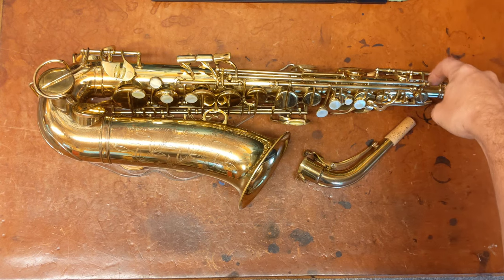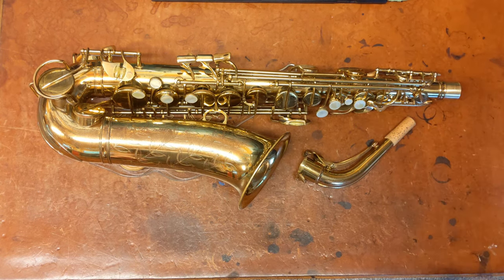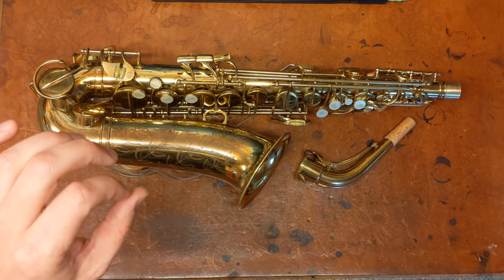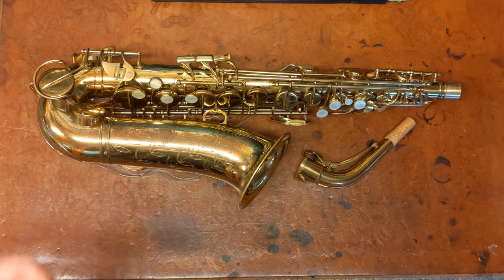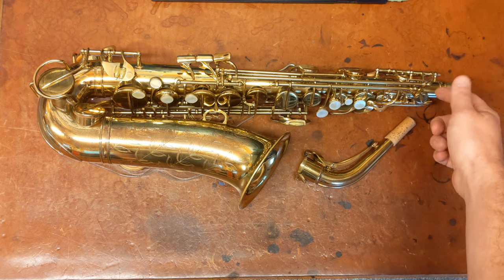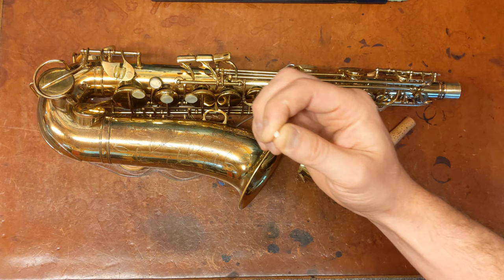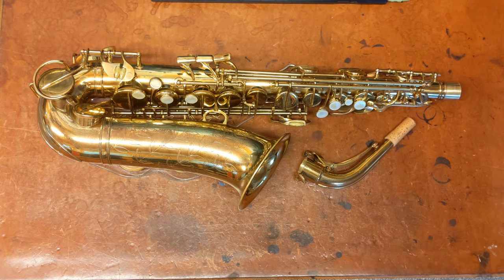Now, these pips are very, very small, and if you're overhauling this, you really have to clean these out. I actually used a pentagonal reamer and was very, very careful to not actually take away any metal material, but it had some sort of calcium buildup in here that I had to get out, that pipe cleaners, or even just the wire in the middle of a pipe cleaner, is too thick to fit in there. So that's something to be aware of.